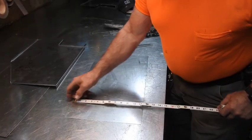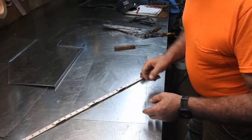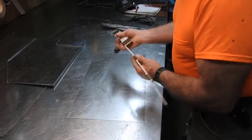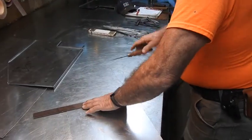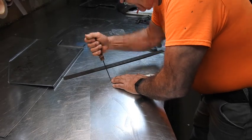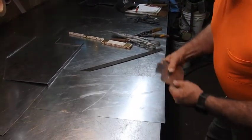I needed 11 and 3 quarter inches in width. This falls 1/16th shallow, so we can fudge that 1/16th of an inch — it doesn't really matter. When you go through the lock former, you've got a little bit of leeway. So we'll go ahead and lay out 20 and 3 quarter in length and double check this end to end for 11 and 3 quarter. Measure up 7 and 3 quarter inches and put the mark on the 1 inch line right here. Double check to make sure there's 4 left over — and there is. That 1 inch line is for the lock former.